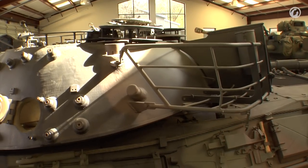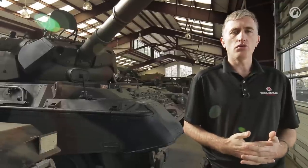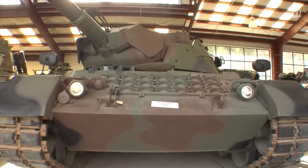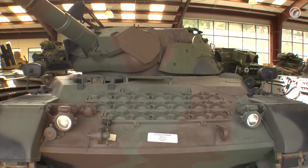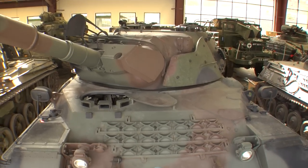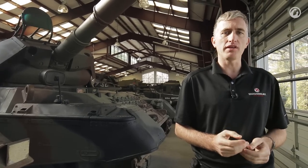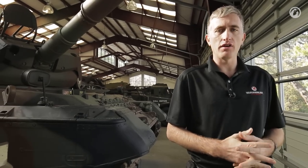The Leopard 1's signifying feature are the large radiator grills on the flanks. On the front of the vehicle you see a whole lot of little X-tiles — these are snow grousers. For something with rubber tracks like the M60, you'd have to turn a center guide inside out to use as a snow tread, which worked in snow but destroyed the road and center guides on solid ground. With the Leopard track, you could remove individual track pads, maybe one every tenth link, and replace it with an X-tile. This gave you snow traction that didn't destroy the roads. Very clever idea.